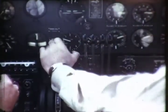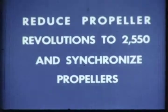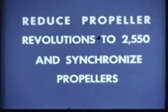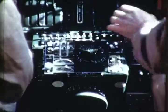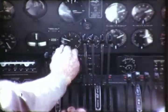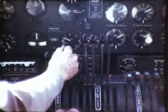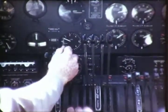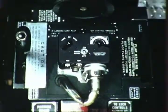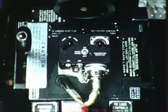Now we retard the turbo control levers to reduce the manifold pressure to 45 and a half inches, the maximum pressure allowable at the continuous power rate for one hour. With the propeller control switches, the co-pilot reduces revolutions to 2,550, while the pilot readjusts the manifold pressure as the propeller pitch increases. After the landing gear lever has returned to neutral, the flaps may be raised at the pilot's discretion. Landing gear and flap control valves are operated only one at a time, never together.